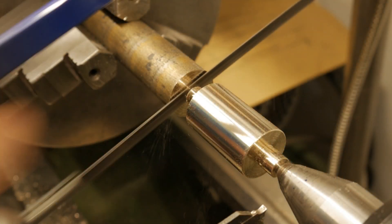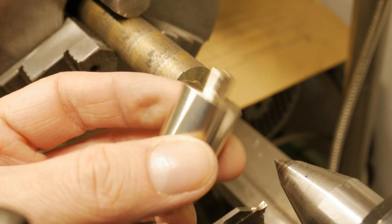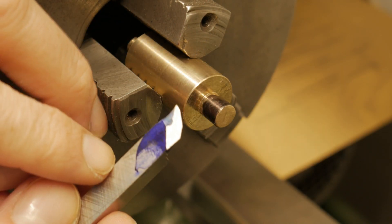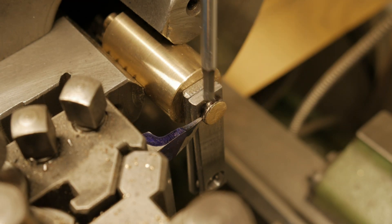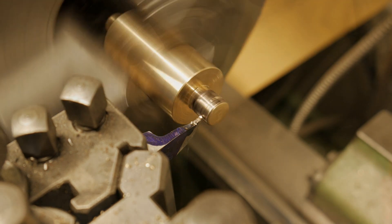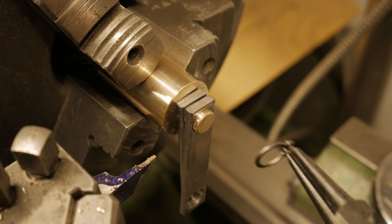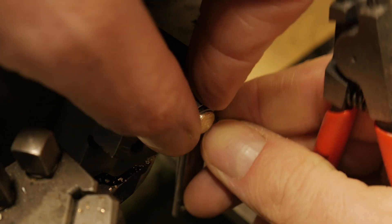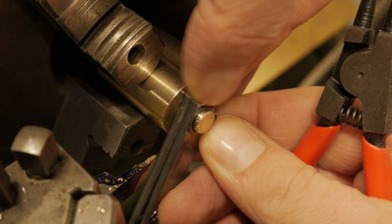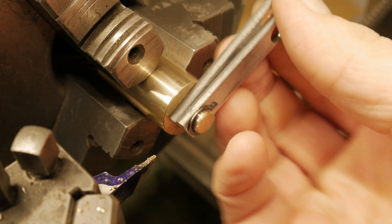I cut with my hand saw and this is the first result from my bronze bar. To make the correct assembly I check if the connecting rod was fitting correctly. I made a special tool of one millimeter thickness to cut the groove for the elastic ring. Before cutting I tried to verify the position, then inserted the elastic ring to see if it makes pressure on the connecting rods — it was perfect. I did the same to the other side and the result was good.